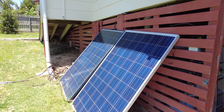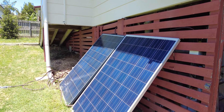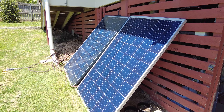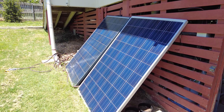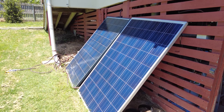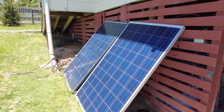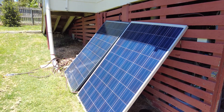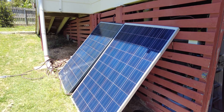During the day these north-facing ones can produce a bit of power — as you can see they're getting a bit of shade — and then the western-facing ones can really kick off in the afternoon. Once again we're over-panelling for the enhanced DC charger; it can only drive up to 500 watts anyway, and combined these two arrays are about a thousand watts. So that's the current system, and when I get my head unit back I'll take you through what's going on with that.